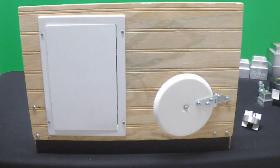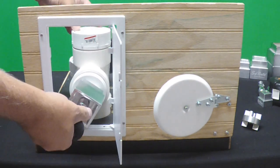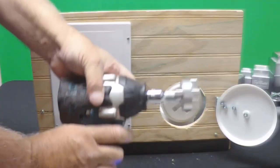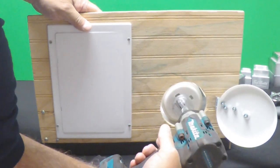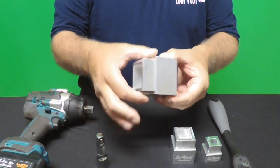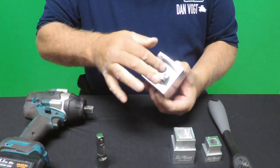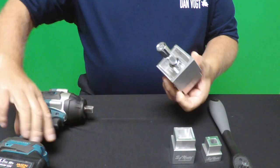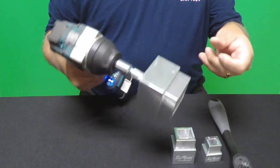The reason this kit is so innovative is if you have a sewer plug inside the wall, this system will go in, go right on that 3-inch cap, and be able to spin that right out. How this system works is the 3/4-inch reducer slides into this tool only, and now we can utilize our 1/2-inch drive, which utilizes the breaker bar, a ratchet, and even an impact.